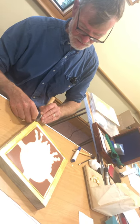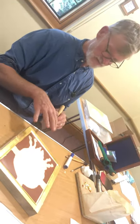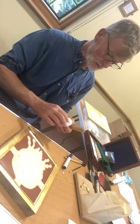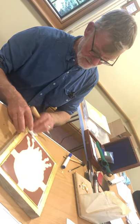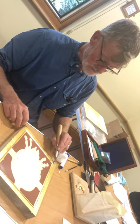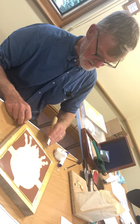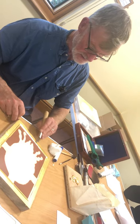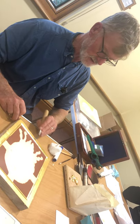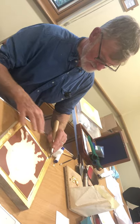If you do get an area where it's damp enough to burnish but not too damp, and you find there's a bit of discolouration because some of the glue has soaked through, get a cotton wool with rubber and that can remove the stuff that's risen to the surface through the pores. That dries away and then you can carry on. The ideal is when you feel this lubrication, this oil on it — it's like a film of oil — and it goes really nicely.